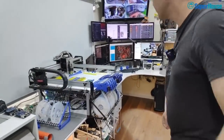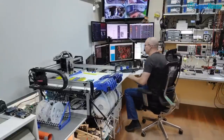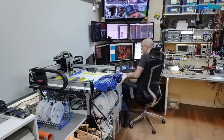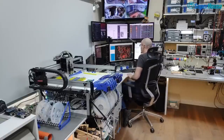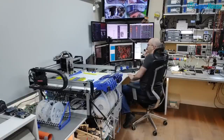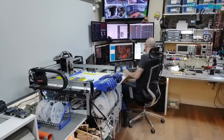The really nice thing about this is that it's got USB-C on both the transmitter and the receiver, and it's got a LiPo battery in it, which in theory should give me about 5 or 6 hours of life, which is a huge improvement on the other radio mic, which had 2 AAs in it, and would go flat really fast. What I really don't like about using radio mics with regular batteries is that you can't begin an event with a battery that isn't full, because you don't know how long it's going to last. So typically what happens is you end up pulling out the batteries and replacing them right before you start every single thing.